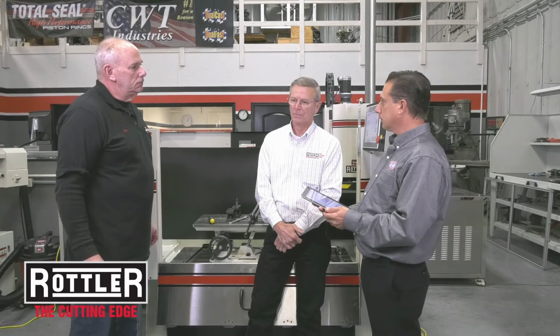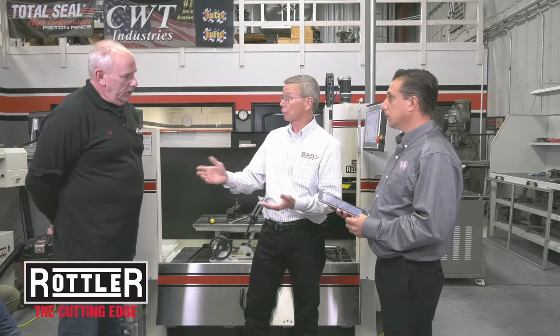Makes sense. All right, we've got a question from Frederick from Norway, who just wants to know, what are they spraying on top of the deck before machining? So do you use anything, Joe, during your machining operations? We do not. We do ours dry most of the time. Every once in a while we'll use WD-40 or just some lubricant. Okay. But most of the time dry. Iron always dry, aluminum every once in a while, WD-40. Okay, and that is just to keep the tool bit from picking up a chip. Correct. And marking the surface. That's all it's for. Yep.